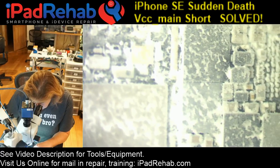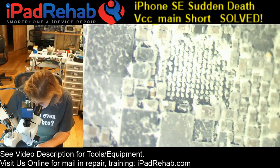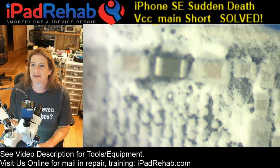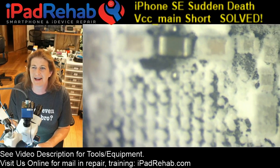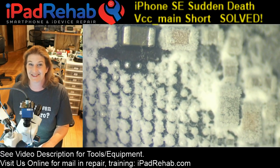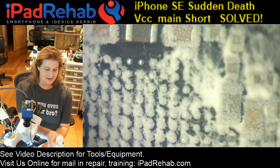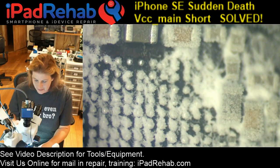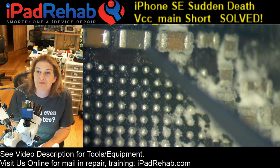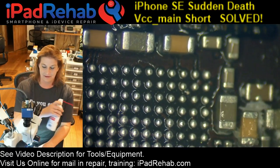Any minute, somebody is going to stand up and say, "It's me! All right, it's me! Fine! There he is! Got you! Is it you? It's me! Fine! I give up!" Now, this really drives me crazy because I told you guys that my thinking was audio IC, and that was the very first spot that I went. In fact, the VCC main ball that I've seen go bad before is this one right here. The culprit was right next to it. Grr! I wish I had just accidentally knocked him off when I was taking off the audio IC.